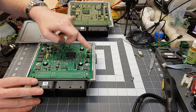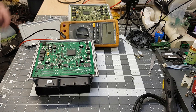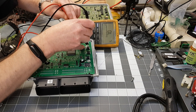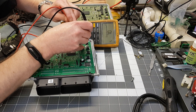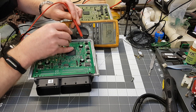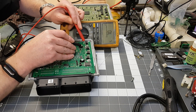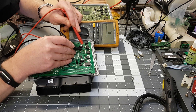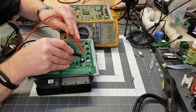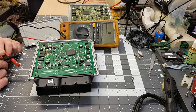The MSD81 is similar on the inside but the drivers are stacked differently. When they fail, they don't show the same issues. This is a particularly bad ECU that doesn't fire any coils, but on the diode test with black on the back, we're getting readings of 0.7 and 0.6 consistently across all drivers - which looks normal.